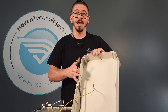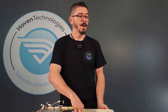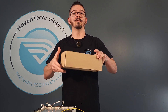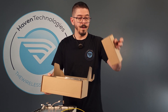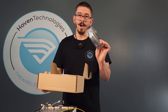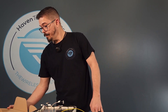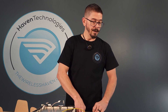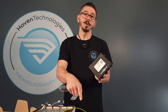Most of you know that the Invisigig is not PoE on its own, so how do we take the PoE power and put it into the Invisigig without damaging anything? This kit will include a 72-watt PoE injector with power cord, and a 48-volt to 12-volt PoE splitter — our Wi-Fix exclusive. This is high powered, way more than you'll need for your Invisigig. You'll plug the PoE splitter into the Invisigig for power and Ethernet, plug the SIM card into the SIM card slot, and this will mount to a plate which goes on the back of the antenna. All of that is included.